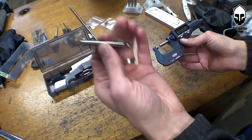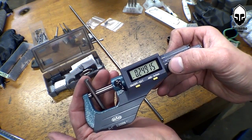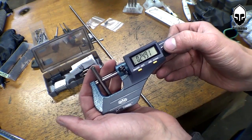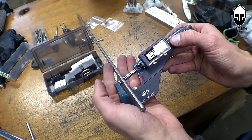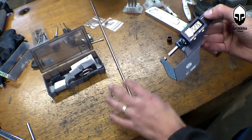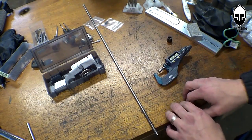I put in this spot drill, which slides in very freely, and this measures 0.2491 — so instead of 0.250 which would be quarter inch, it's just under, nine-tenths smaller, just under one thou smaller than quarter inch. Whereas the titanium bar measures 0.2508 — eight tenths higher than quarter inch — making the titanium bar about a thou and a half thicker than the other one. So the titanium rod is oversized by just a hair. Different rods come in different tolerances and some are going to be over and some under — it's just a variance like that.